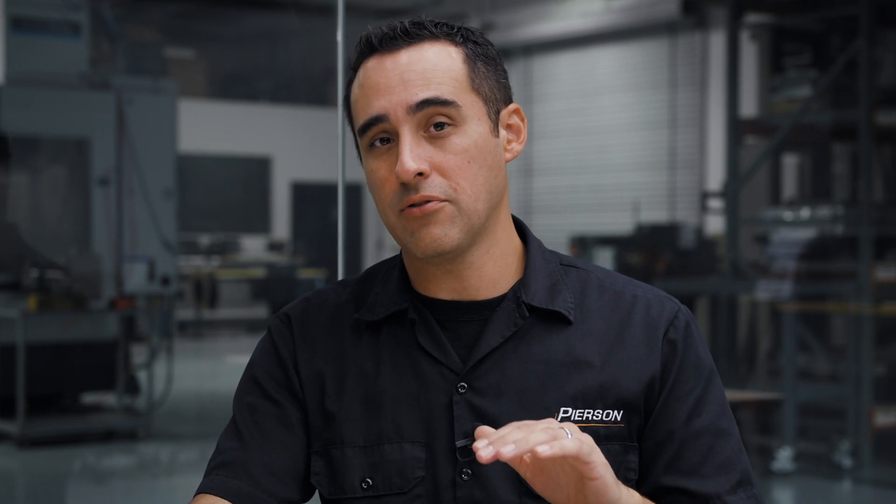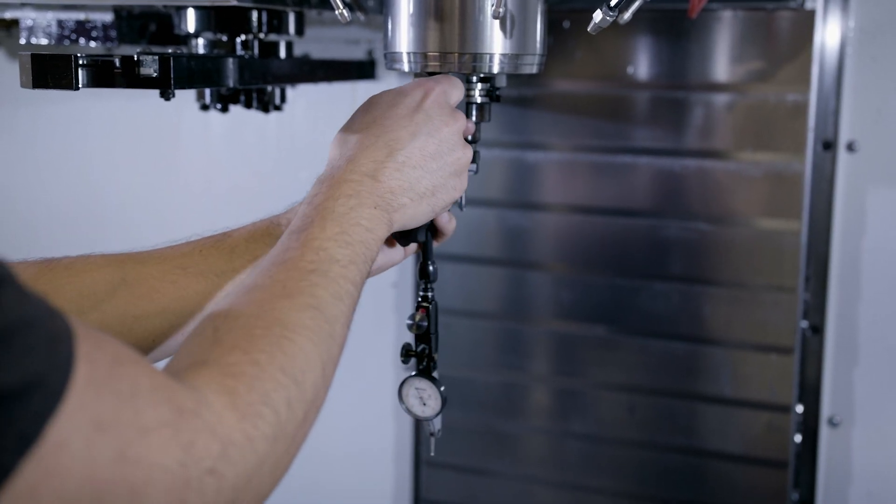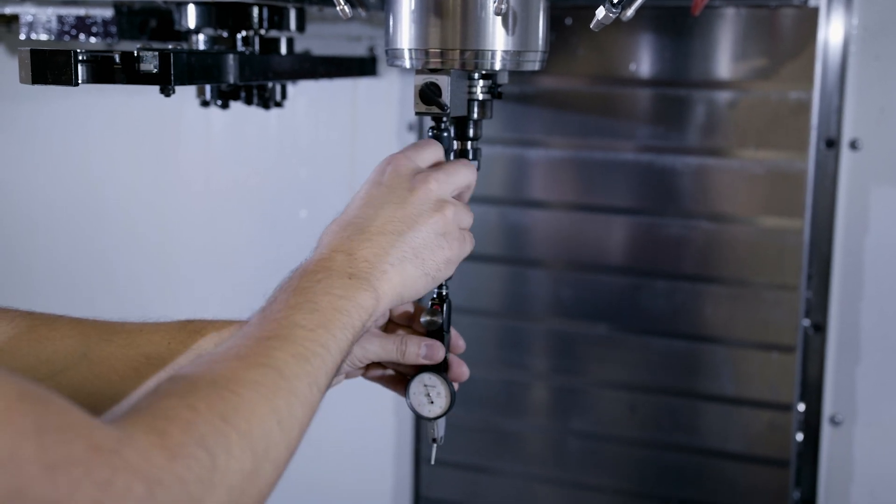For the next application, you can mount all of your vises on a pallet. It does build up the total height of the vise by about three inches. You should definitely face the pallet first so you know it's flat and trammed in with the head. We recommend drilling and tapping — typically half-13 threads. If you have a vise that uses toe clamps, I'd recommend four of those; if you've got an older Kurt with the two tabs, two is just fine. The beauty of this is you indicate that vise one time, lock it down, and you never need to indicate it again.